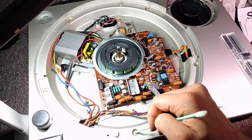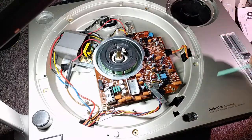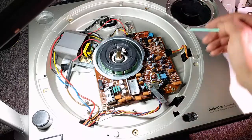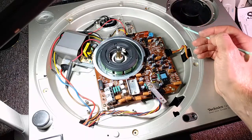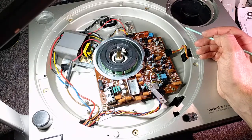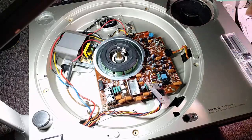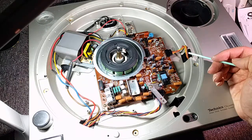I would like to drill out the remaining bits of these washers that are rusting just a tiny bit — not a big deal, but worth doing eventually. I need to secure this case with screws because it has a little bit of lip play, which will affect the way it's tracking on records — so that's not good. I don't normally secure the tonearm; I might finally do that. The tonearm — if it's a 15-millimeter cartridge, it should be at zero height, which it is. I didn't calibrate the anti-skate. You're supposed to put it at 0.5 and align the spring to the little pin it pushes against. I'll double-check the manual on that.